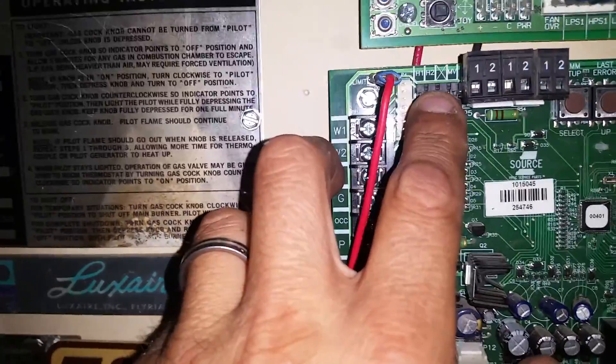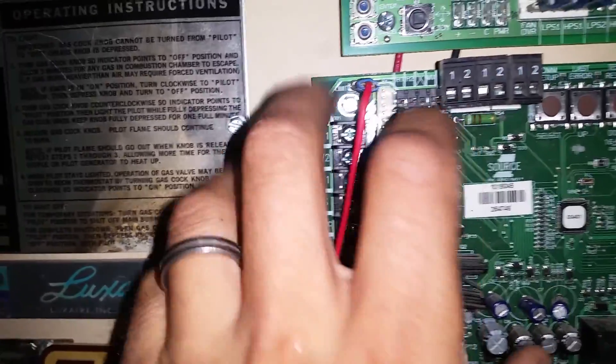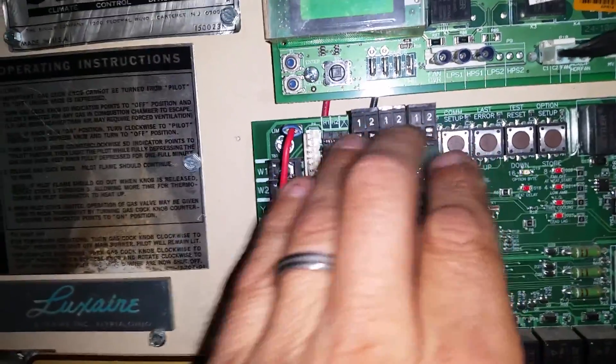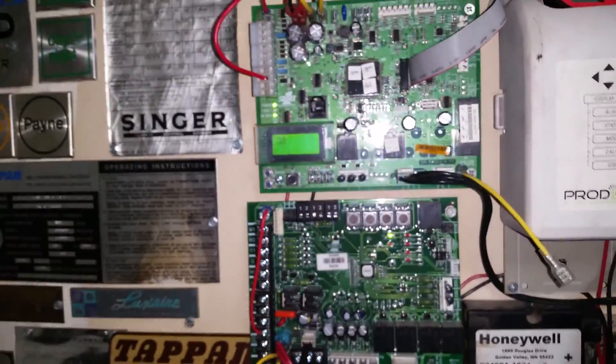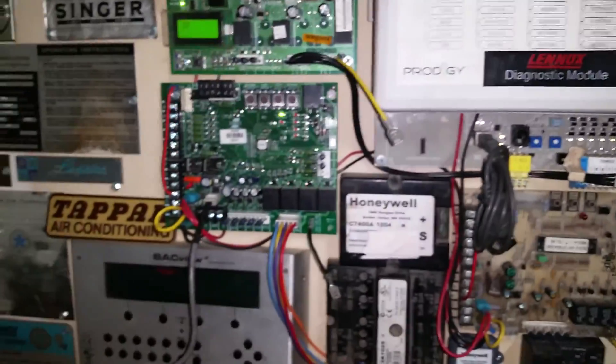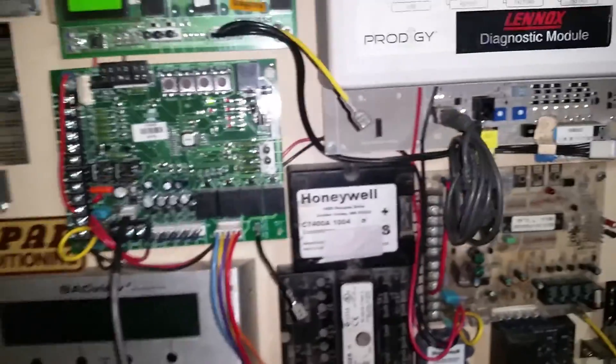These are all preps — we don't have a bunch of alarms. We're not going to worry about our outputs to our heater or heat board, nor are we going to worry about these pins I added for troubleshooting. Those are our economizer outputs and inputs. Now we're powered up and we're going to jump to the laptop.